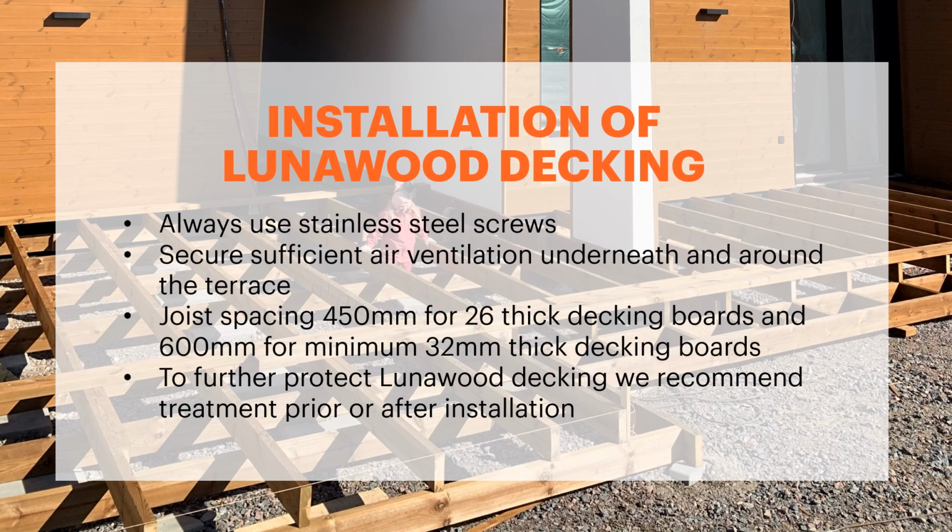Although thermowood is thermally treated throughout the wood, we recommend that the boards are end sealed after cutting with a clear, water-resistant surface treatment. And also to further protect Lunawood decking, we require it to be finished with minimum water-based surface treatment prior or after to the installation.